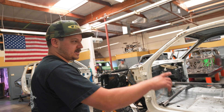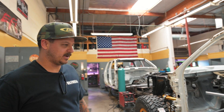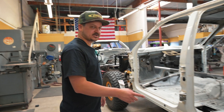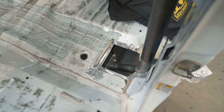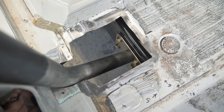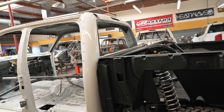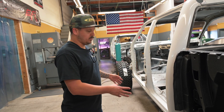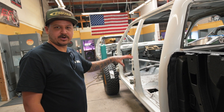This is the whole set for this truck — a 2012, I want to say. We got the cage all prepped and ready. The pillars are prepped, everything's ready to go in. This one's slightly different because this truck wasn't getting caged originally, but we made some bolt-on plates on the powder-coated chassis just in case we wanted to cage it eventually — and now we are. We'll tie into the bed cage, and the whole cab and cage will be one piece, then unbolt from the chassis, powder coat the whole thing, send it to Line-X, and put it all back together.